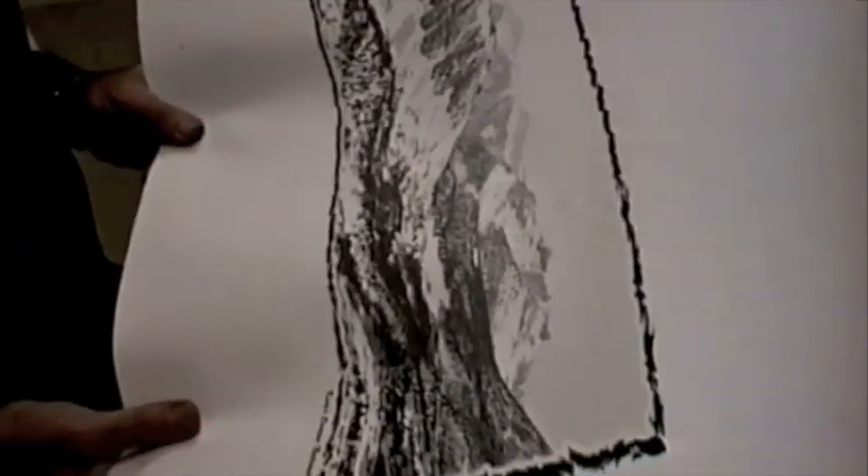Sam has explained that when he measures the densities, he's checking to make sure that it's the correct density. If it is not correct, he will correct that by mixing the ink — by adding something to the ink — and produce the correct formulation. Once you have that correct formulation, this is a very stable process. Assuming we make the image carry the same every time, we don't have to go back and make different adjustments on the press to change the density — we control that by the mixing process itself. This makes the process a lot easier to set up than the litho process where you have control over ink density on press, eliminating that variable from our process.